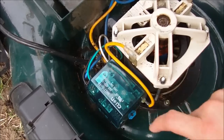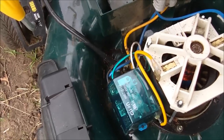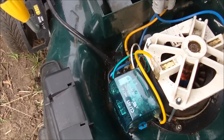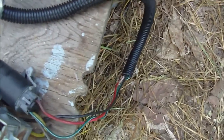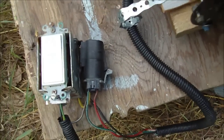There are very thick windings on the armature, as you can see. Then we have a relay — it's a very heavy duty relay, 100 amps, 30 volts, so that's quite a high current relay. The reason they have to use this is because this motor is such a low voltage — only 24 volts — so we have a lot of current. We wouldn't be able to turn this mower on from a switch up at the handle. The hookup of this motor is very simple: we have two wires on the motor, marked negative and positive. You could just run those wires to a switch, but what I've done is wired them to a relay. You flick the switch, the relay trips, and then the current goes from the battery to the motor.